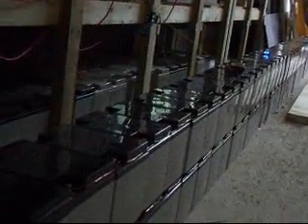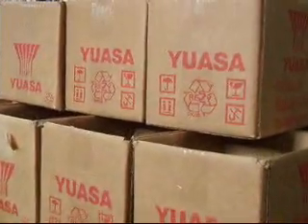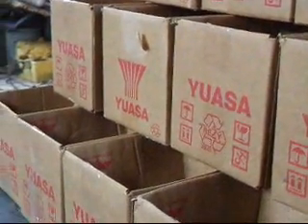For the moment, because these batteries have stood for a year — they were actually brand new in boxes — they weren't used, and apparently the supplier won't take them back if they are more than six months old. So the implication is that these are likely to be sulfated. When they came, they were at a voltage of 12.8 volts, and overnight I've put them on a Bedini charger. Now there's a lot of controversy about Bedini chargers.